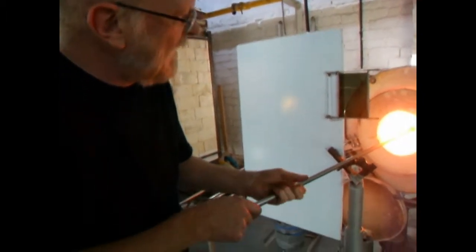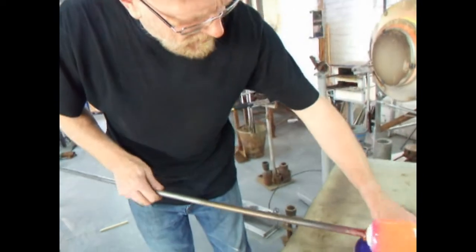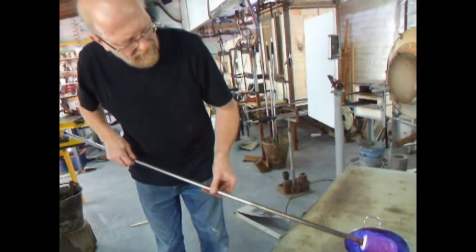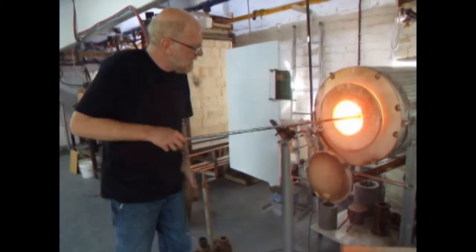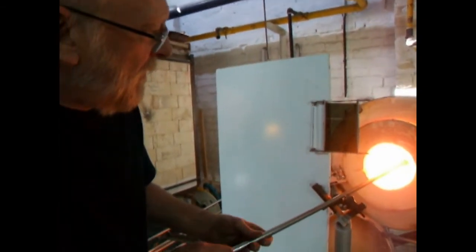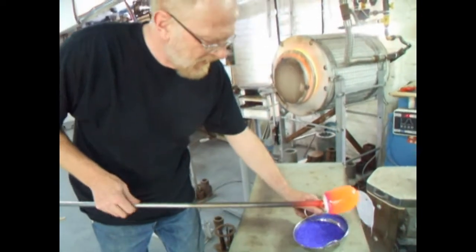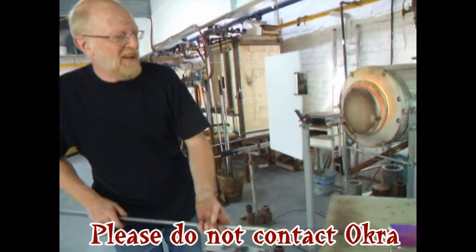You'll probably notice the glory hole unusually actually has a door on it, and you can hear as the door shuts the sound goes. It's because it drops onto low fire, which means it's very cheap to run. We developed the concept for this glory hole about 3 or 4 years ago, and built a very crude version just to see if it would work, and it works absolutely amazingly well. And then Merlin the magician worked some of his magic and made the real deal, which we're now using.